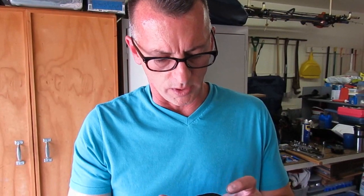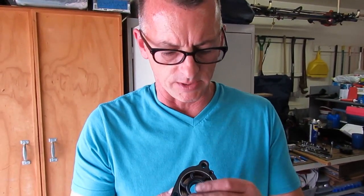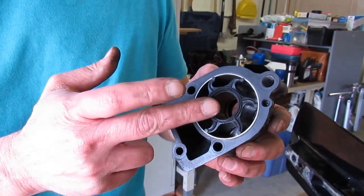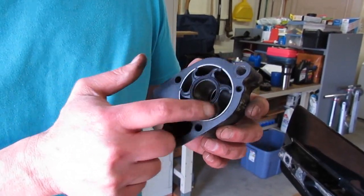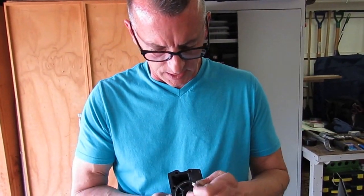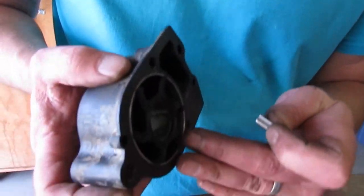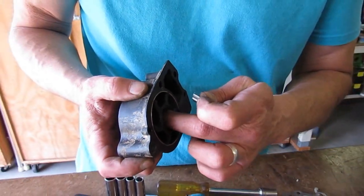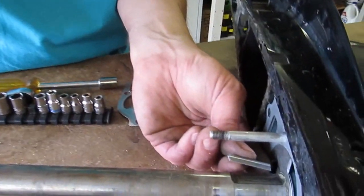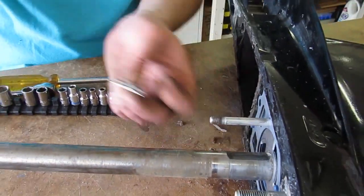A little bit of soapy water helped get the impeller in — it's a bit of a struggle but you keep working it little by little, and soapy water really helped get it down inside the pump. We weren't sure exactly about the orientation so we had to go back and look at our own video and stills to figure that out. I marked where the key slot is in the impeller so when I slide this over the shaft I'll know where it is. You'll need that when it comes all the way down to home so everything lines up.